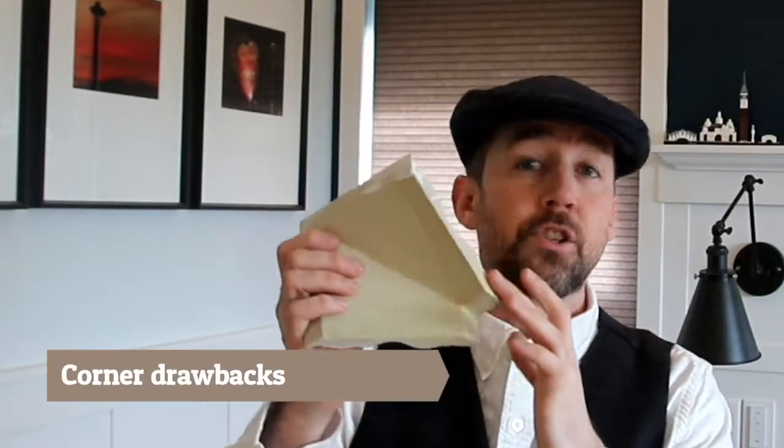The corners all had straight edges, so everything was a butt joint. And butt joints, at least for me, are a heck of a lot harder to hide and smooth with caulk and spackle. If I don't get the distance exactly right — if you're a sixteenth of an inch off — it's going to create a pretty big and noticeable gap.